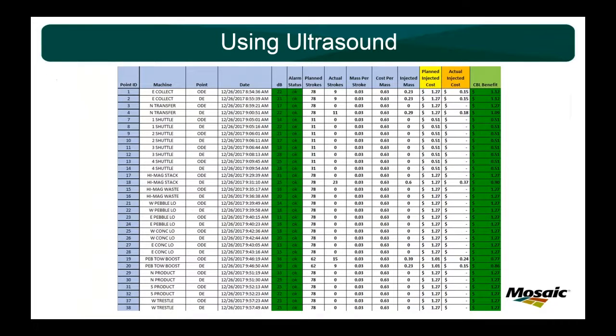And this is probably my favorite slide of the entire presentation, just because you don't hear much about the results of using a condition-based system such as ultrasound. And I've examined many different manuals from U.S. Motors, from SKF, from Shell, from GE, from Siemens, from Dodge, to Baldor, Toshiba. After a while, all those manuals start to say the same thing, and really what they're trying to do is cover all the products in every application. And that's a great starting point. What does the OEM recommend we do to their motor? But it's not really specific to your application.